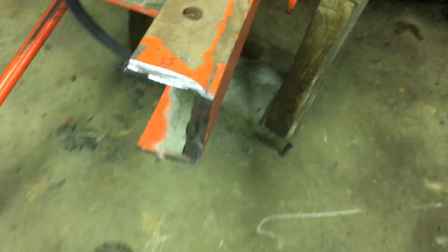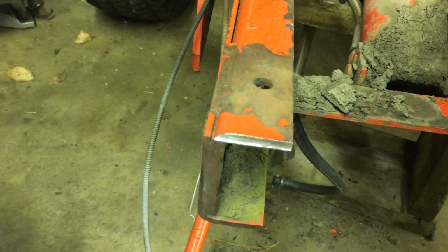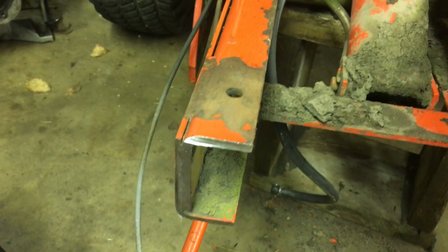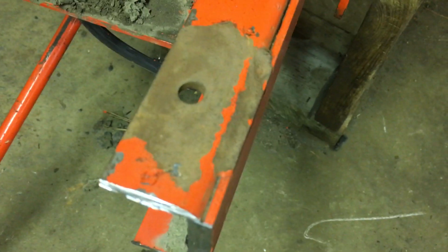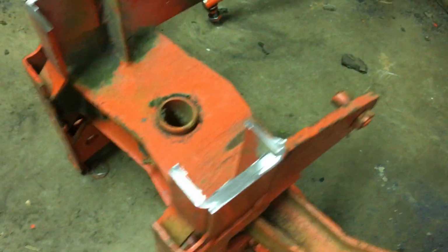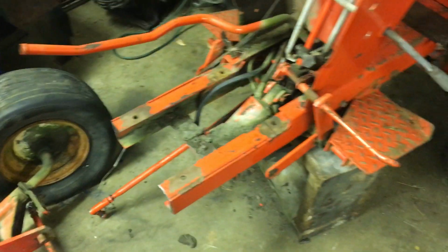It's actually 2 pieces of angle iron. The top flange, you can see the top and bottom flanges are the same size, but the top one sticks in a little bit further because it's the inside piece in the frame rail. But from the factory, they're just spot welded. Like, it's just welded about a 2-inch section there and a 2-inch section there, and that was it. I mean, there's nothing on the top there, and then they just welded it on the inside.